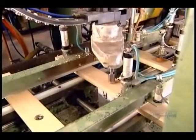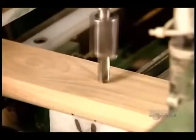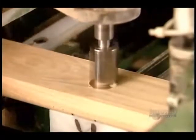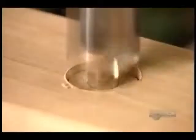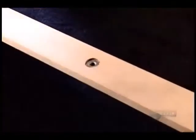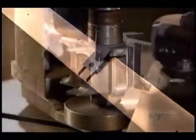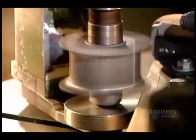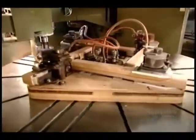These six and a half by 60 centimetre blocks will become push brooms — those wide rectangular brooms janitors use to sweep floors. The blocks go on an automated machine that drills a hole through the middle and carves two grooves in the underside. These are for the steel adapter that'll hold the broom's wooden handle. Rounded push brooms sweep more easily in corners. To produce those, workers just take the rectangular push broom blocks and round the corners against a cutting head.